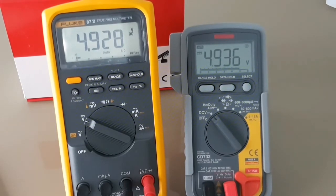Here we go with the voltage comparison. At 5.1 volts, readings are 5.143 and 5.152. At 10 volts: 10.13 and 10.14. Up to 16.2 volts on the power supply — both meters reading 16.3. Pretty well neck and neck. At 19 volts: 19.2. At 23.1 volts according to the power supply — 23.19 for the Fluke, 23.23 for the Sanwa. At 28 volts: 28.0 and 28.1. Maxing out at 31.5 volts — both reading 31.6.